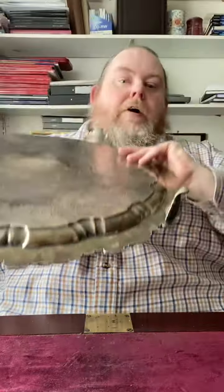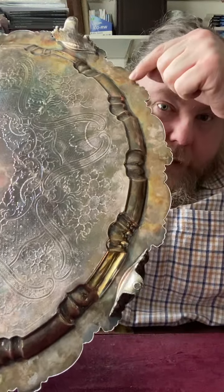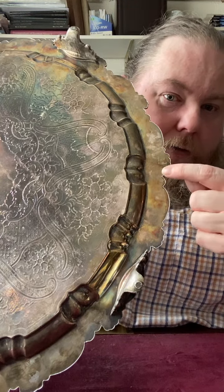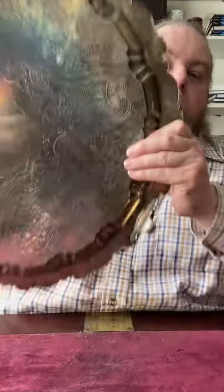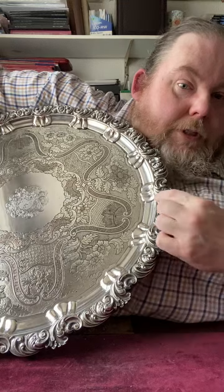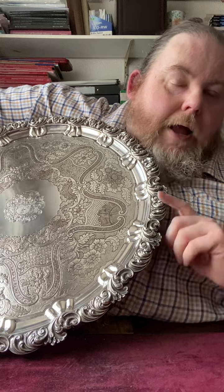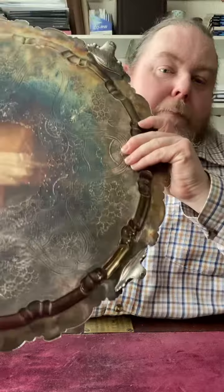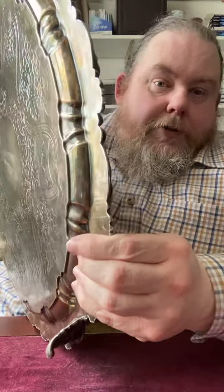And if we flick it over, I haven't polished the back deliberately because it shows up a bit better. Can you see this sort of raised line? Almost like piped icing on the edge of a biscuit going all the way round. Well, that is pure silver from this stamping. So when this is stamped, there's a slight overhang here. And what happens is it's filled in with lead, it's applied, and as it's attached, that is simply curled over. And that conceals, on the very edge here, any sign of copper.